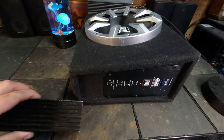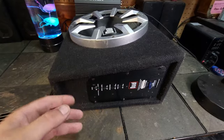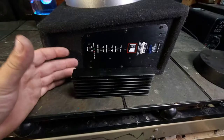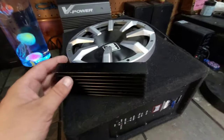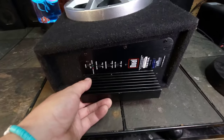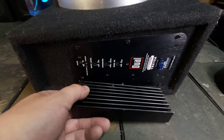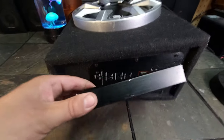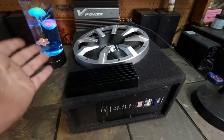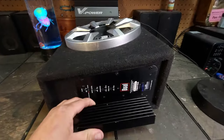I have linked down in the description a little kit that does the exact same thing as this heat sink. Most importantly, the kit includes a thermally conductive adhesive — pretty much an epoxy glue that allows heat to travel through it very efficiently. What you do is put a good amount of adhesive on there and then just place the heat sink right on like that and let it dry. This whole thing is a heat sink, so you want as much surface area covered as possible to transfer heat. Do not use JB Weld or anything like that — it will act as a thermal barrier and won't be thermally conductive. Check out the description or find an old receiver and grab the heat sink out of it.